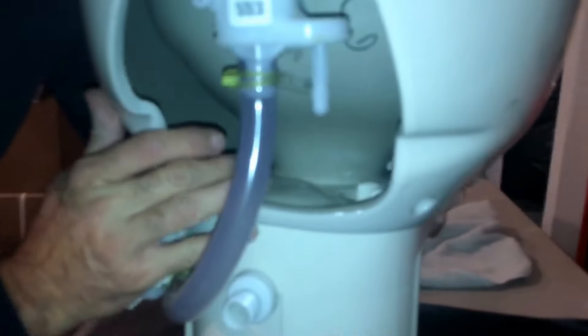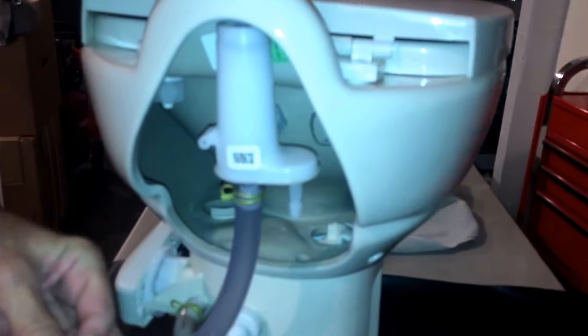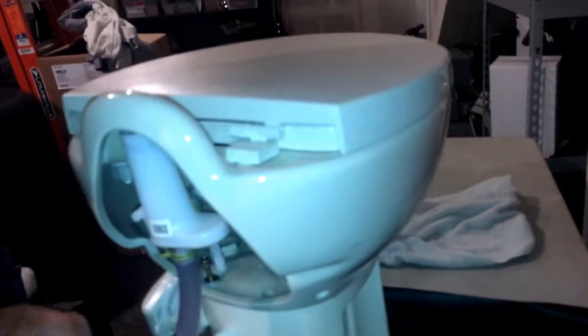Set it up on top, look through the back, and rotate it into place. As you rotate it, you'll be checking the seal on the inside. Looking down in there, you can see the seal is a little bit off-center — if it's not centered it'll still leak, so we want to get that back on center. We can adjust it back over and re-secure it. Line up the bolts, check the seal — it looks good now. Got the washers in the right orientation with the plastic against the ceramic.